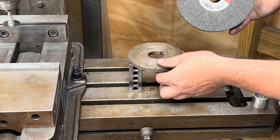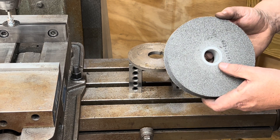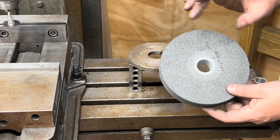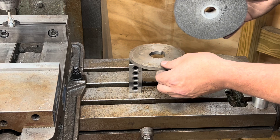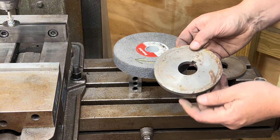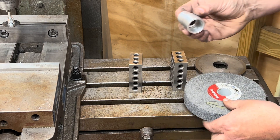So what I am thinking — and the problem is this is a one-inch bore, and I need it to be an inch and a quarter. There does look like there's enough remaining plastic here to take care of that, but I want to try to bore it as concentric as I can. So I'm fortunate enough to have a couple of these metal plates, which are one and a quarter inch arbors, and I also have some arbor adapters.